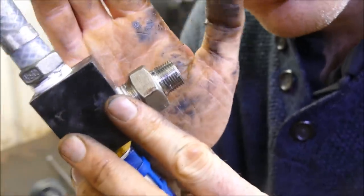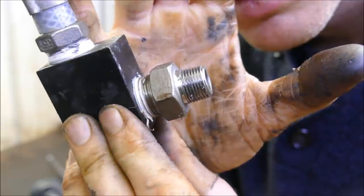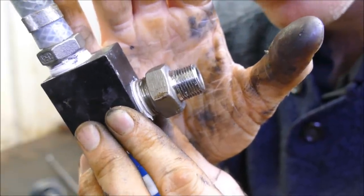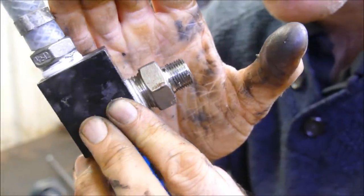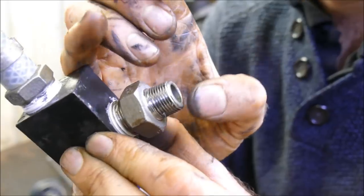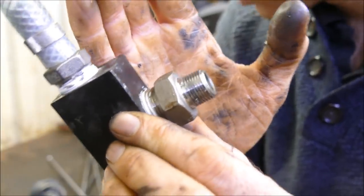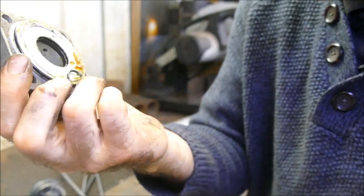I think that these fittings, as you can see, are tapered, and as you wind pressure in, it kind of forces and expands into the joint. Now the dangerous thing is if you over tighten these, you'll break the aluminium, because this is stainless steel. And I think along with all the shock, these want to come loose and tighten as they get pounded through the hammer, and that would have contributed to the cracking of that aluminium casting, as well as from it beating itself up inside.